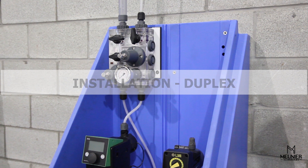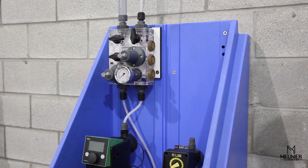The DICE DS and DM modules are equipped with three ports on the side that can be used for secondary pumps or additional accessories such as a pulsation dampener, pressure transmitter, etc. In this case, we are installing a secondary pump on one of the auxiliary ports. This is now a duplex system configuration. Additional check valves may also be integrated in the duplex configuration to allow for 100% pump redundancy.